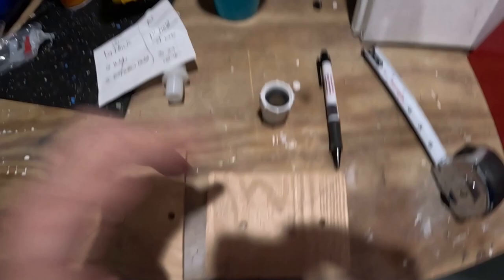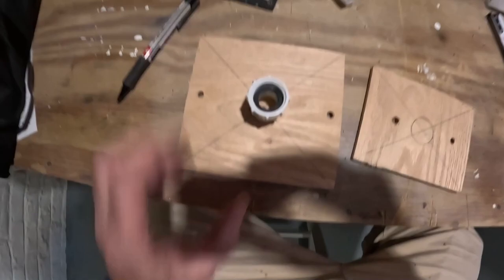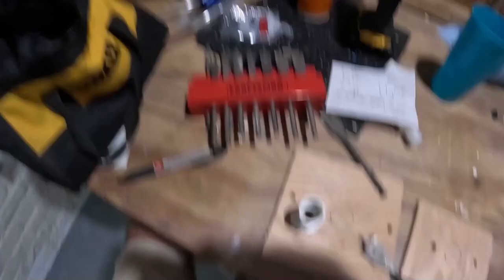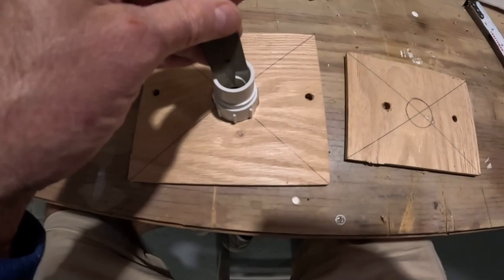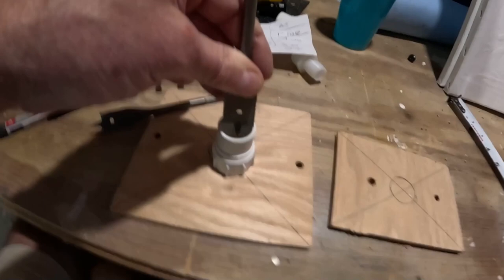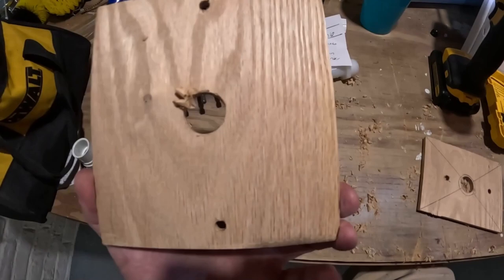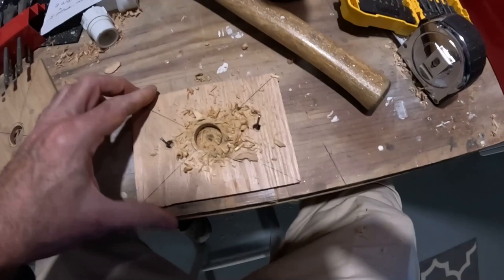All right, and there goes everything — so I'll do the other three right now. Got my holes circled — I used that center measurement at the cross, put that on center, circled it with a pen. Now I'll figure out how I want to cut it. I don't have a bit that large or a hole saw. Actually, I might — I might have some bits that big. Voila, forgot that I had these. This is one inch. I'm going to go seven-eighths — actually maybe a little smaller than seven-eighths. I'm going to make it a tight fit, so seven-eighths will work pretty good there. I might adjust that. Hopefully you can cut through this oak wood with that DeWalt battery operator — I'm sure I can. This one turned out perfect because I went slower and let it chew away at the wood. You might need to go a little bigger — we'll experiment.